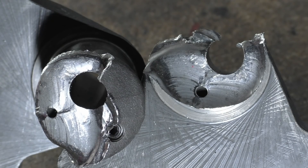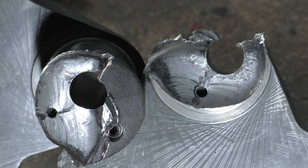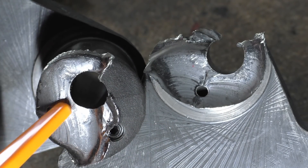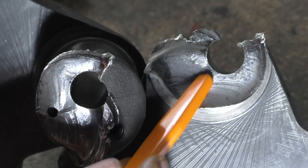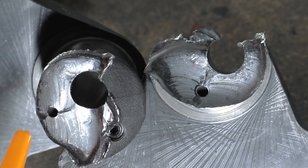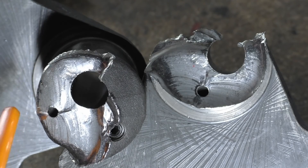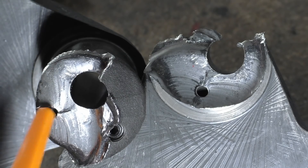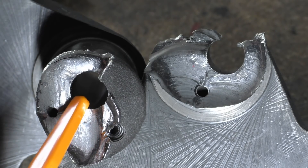What we want to do first is look for the smallest cross section, because the smallest cross section is usually the weakest part — not always, but most of the time. What we can see is what they call a river bed, which is this bit here — it matches up there. This is what we call a river bed, and it goes directly from the outside surface directly to the hole through the center and then to this hole.